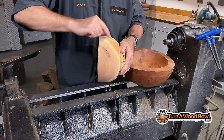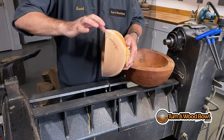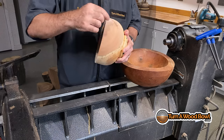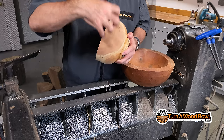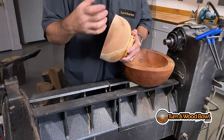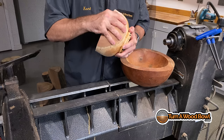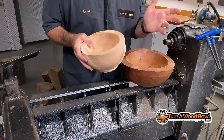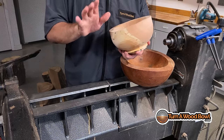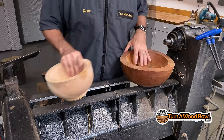The side grain, if you think of this like straws, they're running this way, and the moisture doesn't come out of there as quickly as it does with the end grain. These are the holes or the ends of the straw, so the moisture is going to come out very fast here, and that makes this area prone to cracking. So when we seal that with Anchor Seal, it's good. And then I literally just set this on a shelf, or I might put it in my dryer and let it be. And you can leave them sit for a good period of time.